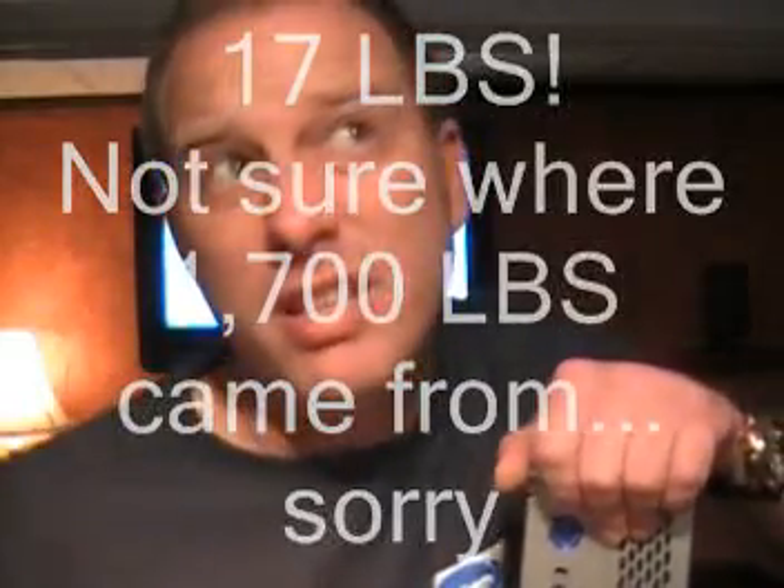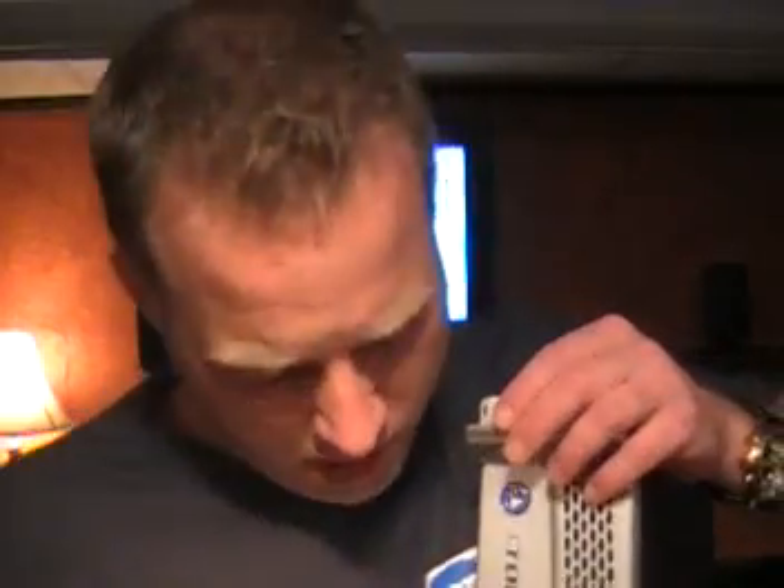Now, these came out in 2006. And I was a little afraid of them at first, because it was really new technology. They're digital amplifiers. There's digital signal processing in these. You can adjust them with computers, adjust crossover points, EQ points, limiter points, all kinds of stuff. I was like, something's going to go wrong. I don't want to get in on this until they've been time-tested and proven.